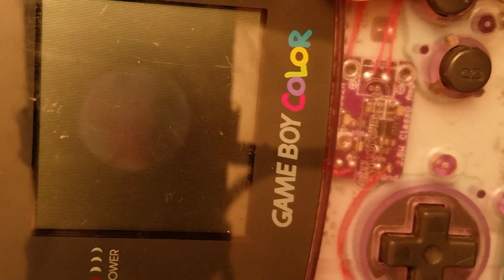Now, you may find a point where you've turned it just a little too much and it's gotten quieter. If that's the case, you want to back off and turn it counterclockwise, because you've either reached its limit, or it's just not the right setting. The other thing to take into account with these amps is that you might find a dead spot. Let's say it's getting louder, and then the next time you turn it, there's no sound at all, or it's almost gone. Then you can try a little bit more, but if it does nothing, you need to back off. But 99% of the time, in my experience, when you have a dead spot, turn it a little bit more, and generally you'll get to that point where it's ear-bleeding loud and it's just insane.